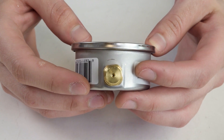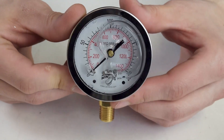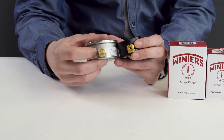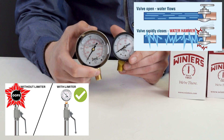These come with a threaded orifice. The reason is that if it's being used on a clean hydraulic system, they may want a restrictor on it. If you open up a ball valve with a hundred PSI, it will hit a smaller entrance allowing the blow to be absorbed without damaging the gauge. Whereas if you didn't, all the pressure could hit at once, potentially harming the gauge and also creating a hammer effect.